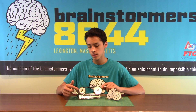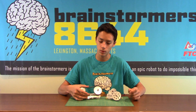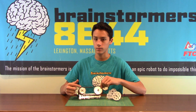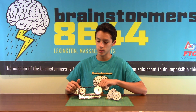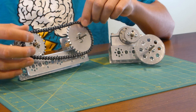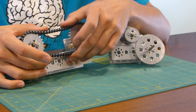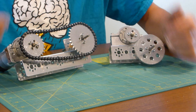Whereas with chains, they're generally used for higher speed situations and there's also a lot of slack, so in higher torque situations there's a lot of unreliability. There's also a lot more work that goes into these chain systems because they have to be cut to the right length, and they also have to have the perfect amount of slack. Over time the slack builds and there's a lot of maintenance to make sure that the slack is the correct amount.